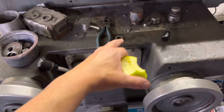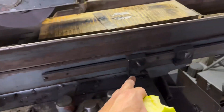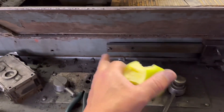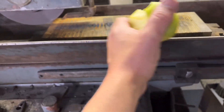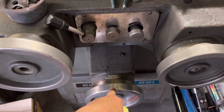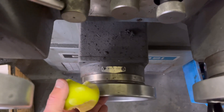Here you've got the adjustment for the table. The more you move this lever over this way the faster the speed will be. You've got your two stops here — they work off this slide and just hit these two pegs to change direction. The closer these are, the less travel it has either way. The big dials here control the vertical feed up, and each increment is a tenth of a thou, so from there to there is one thou.